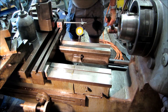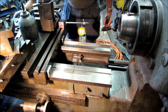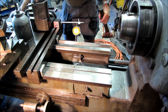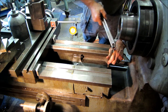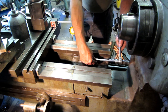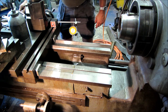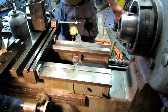Still about half a thousandth right there. There are no dowels that lock this into place - you've got to manually put it in. Sometimes getting over on the other side helps relieve it. When you get a zero reading on both sides, you're there. Don't remove the indicator yet because you want to make sure after you finish tightening it down - remember you floated it in on oil - that you weren't getting a false reading. You can see the oil squirt up and squeeze out all the way down. I can't see the needle move from one side to the other - it feels smooth. That's setting the gap back in place.